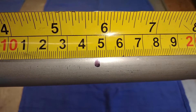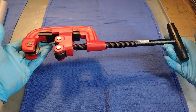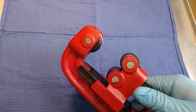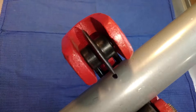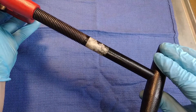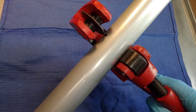I've got a mark at 145 millimeters, and then I'm going to cut this tubing with a pipe cutter tool. If you've never used this before, it's easy. It's got these two rolling wheels, and then a cutting wheel on top. You place the pipe you want to cut between the two rollers, and then you tighten down the cutting wheel to the exact spot you want. When you tighten the handle on these tools, you just do a little bit at a time — you don't want to go too much at any one point, or you're going to distort the tubing and make it out of round.